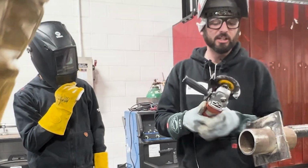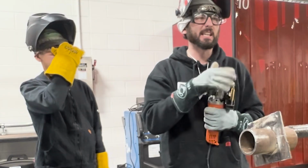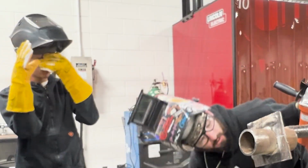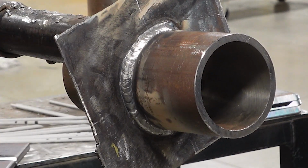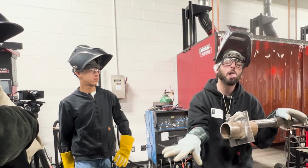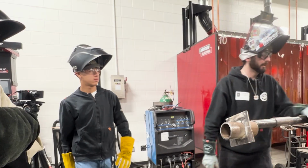So I'm gonna aim this wire wheel for the edges of my weld more than anything, because I almost want to let this thing push and smear a little bit of that weld to blend it a little bit. So we do have a smidge of undercut on that start, and that's okay. I do believe it's because we didn't have enough heat and it was too soft. It didn't want to lay down because it was trying to not be laying down with that soft setting.